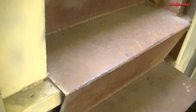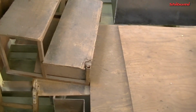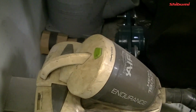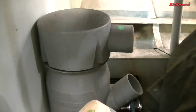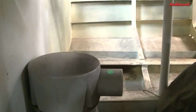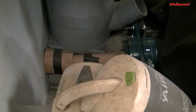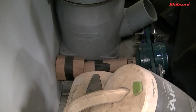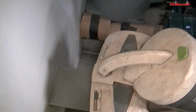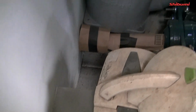So moving on, the next thing that I'm going to work on, because I can't get outside and we're nearly ready to complete the hull, is the exhaust. So if we just wait for the light to get in here, that's the exhaust. If you look at the top pipe coming out of the top circle, that needs to be pointed towards that wall over there. But this one lines up directly with the manifold. So as you can see in there, it's sitting literally down beside the shaft. I'm going to keep that up maybe 3 or 4 inches above it, and make 2 sets of angle irons that will cross from one side of the engine girder, right there just behind that vacuum cleaner, to the other side, and mount that on it.